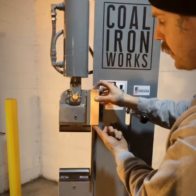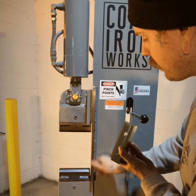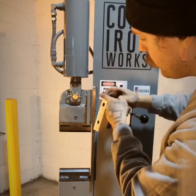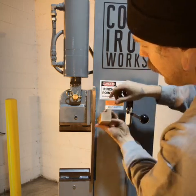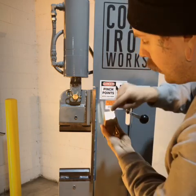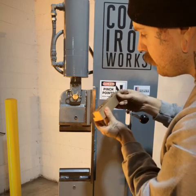I've gone ahead and removed the bolts attaching this bronze L-jib. We've got our steel slide plate that extends all along the front of that frame and is welded in place. Then we've got a bronze L-jib, a center jib, and another L-jib on the other side. If I go ahead and face off a few thousandths and reattach this, that's going to take up any slop between the back of the L-jib and the slide and tighten that back up. As the machine wears, you want the bronze to wear rather than the steel, and you can reface this a lot before you'll need to replace the whole piece of bronze.